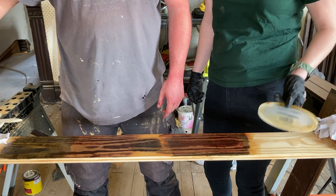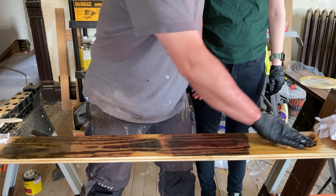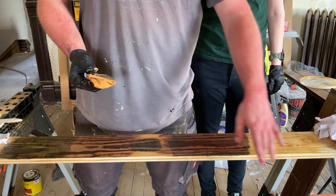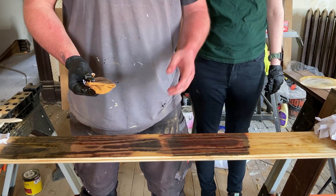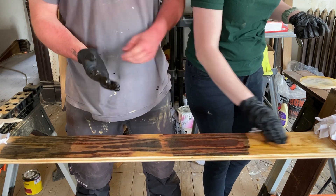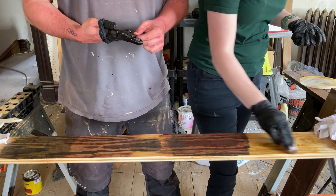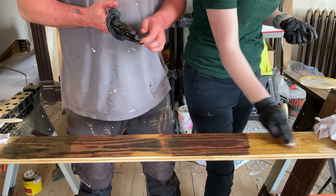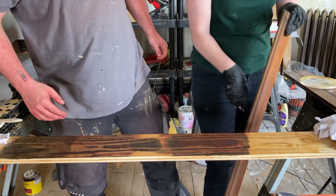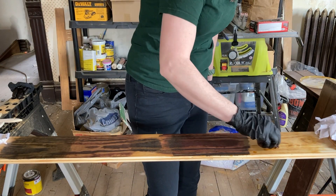Let's try over here — just put the shellac straight on. It'll go very orange because pine is a very bright wood. Some of our boards have much closer growth rings like that one there, but not this one. It's just not giving enough red — what we're going for is like a very cherry kind of look, like a cherry wood. I'm just surprised that the red mahogany was such an awful color. Pine is not a great wood for staining.